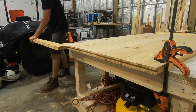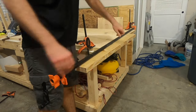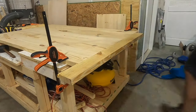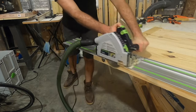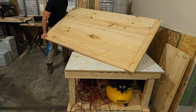The dovetail tongue fits in the dovetail groove and then you can tap it in place with a hammer. It sometimes helps to put a long clamp across, but I find it's a little easier to just tap it into place. I once again use the track saw to cut the breadboard in flush. The main reason I do the breadboards this way is to allow for wood movement over time as the middle of the table expands and contracts.